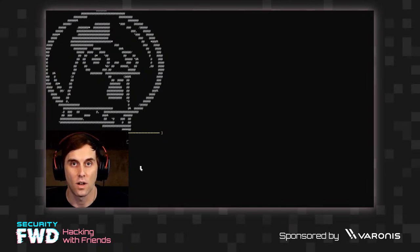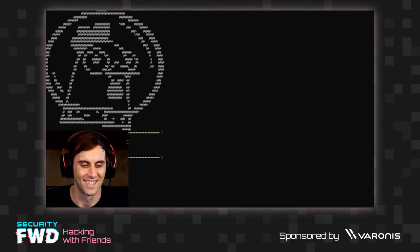Okay, cool. So we've gotten to the point that we are... well, you haven't yet, so you're not connected yet. But how does that look on Windows? Same way. I have mine already plugged in. I know it's COM3 because COM1 is usually just there on a lot of systems. I don't know what it's for. Maybe someone smart in the comments is going to point it out. But COM3 is actually the deauther. So I say 0 for COM3. You can also type COM3, by the way. And now it says, hey, I'm connected.